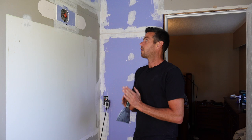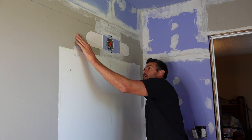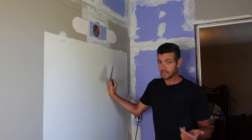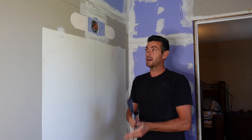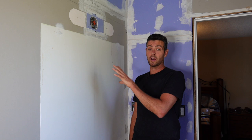The second time I add glue — and this one's really important — is when I'm going over a painted surface. Especially in a bathroom; maybe it's got a gloss. Right here is a pretty glossy bathroom paint. In the past as a young buck mixing up quick set and trying to get jobs done quickly, not adding any glue because I'd never heard of it, there were a few occasions where I actually had the mud delaminate, especially on a glossy surface. Some people would say just sand it, but I say not good enough. I want a hundred percent guaranteed adhesion. I don't think just sanding one of these greasy glossy surfaces is going to be good enough, so I like to add glue. That's the main reason I started doing it — having quick set patches delaminate off the wall.